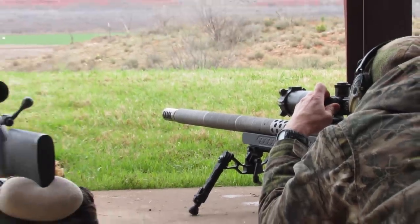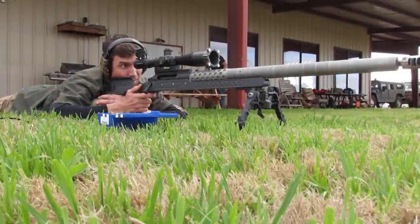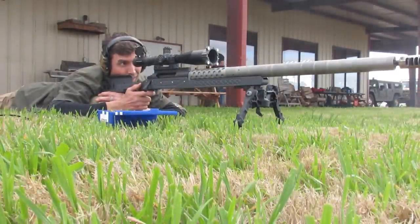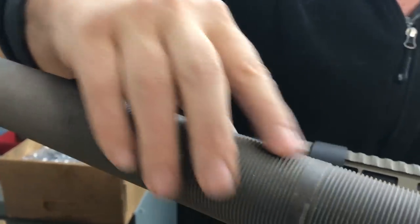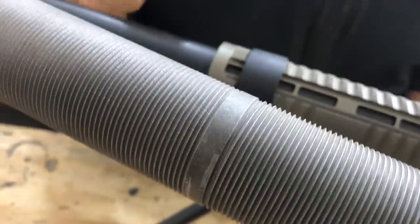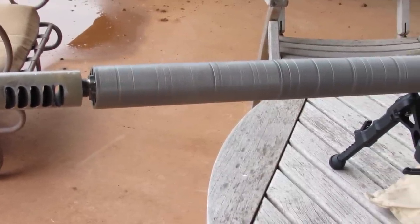The design moves a lot of metal, so you get the rigidity of a very large diameter barrel — about two inches — but remove a lot of the weight, making it still transportable. The threads on the outside are done in a pattern they call the fallen angel pattern. In general, harmonics propagate efficiently through a more uniform structure — like a bell, a pipe, or a pipe organ, those harmonics reverberate uniformly. If interrupted by different geometry, those harmonics don't know where to go. That's how a muffler works. Structured barrels basically alter the homogeneity of themselves to eliminate harmonic translation section to section.